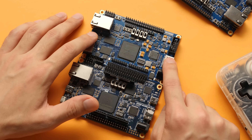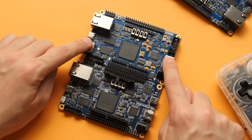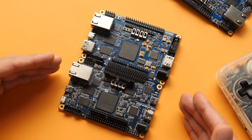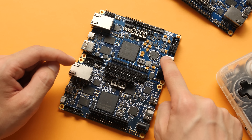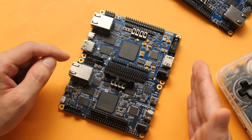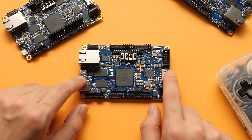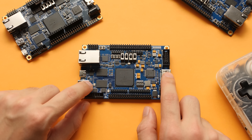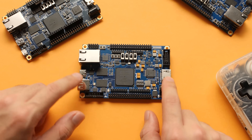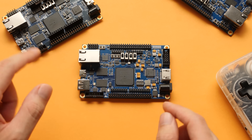There are a few other things you won't be able to notice. This new board can be powered by 5V DC or 12V DC, whereas the original one can only be powered by 5V DC. There is a side benefit to this, where the new board will use less power than the old one when running the same game with the same RAM modules — about 1 to 2 watts of savings due to the higher efficiency DC-to-DC converter. After I posted that picture online, the creator of the MiSTer project reached out with suggestions for improvements, including a USB header for I/O board compatibility and a power header to improve accessory use.